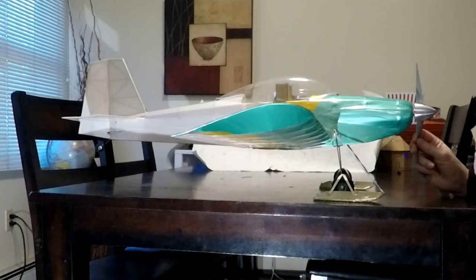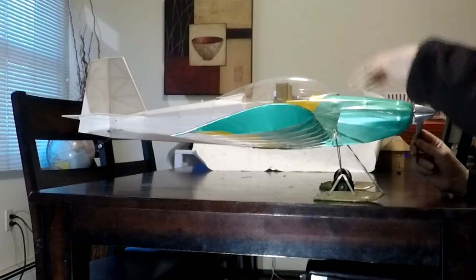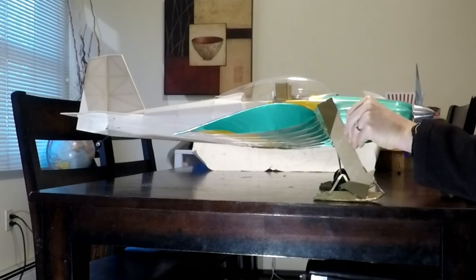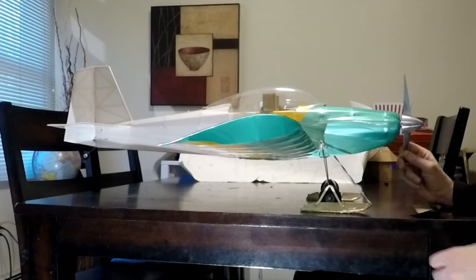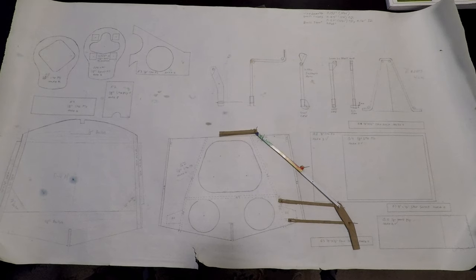The last thing we need to figure out is how far forward the wheels need to be. First you find the center of gravity both front to back and top to bottom, and then starting from that point, draw a line down and forward at an 18-degree angle relative to the aircraft's centerline. Where that line contacts the ground is where your wheels should be contacting the ground — for a conventional gear airplane, that should be somewhere just ahead of the leading edge. With the perfect wheel location in mind, it's time to design a mechanism to get the wheels as close to those points as possible.